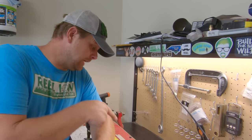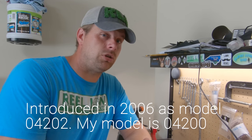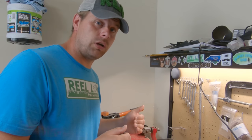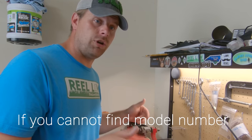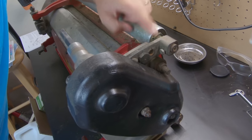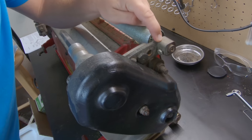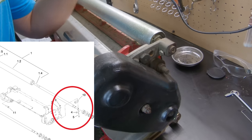This is one of the original cutting units and they've refined it over time. My serial number begins with 250 — you can estimate this is a 2005 model based on that. The newer cutting unit was introduced around 2008 or 2009. The easiest way to tell if you have an older cutting unit is with the rear roller — these adjustment brackets for the rear roller indicate the older style.